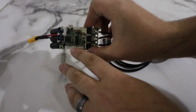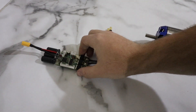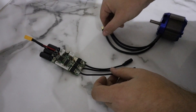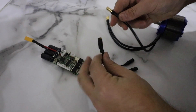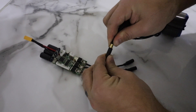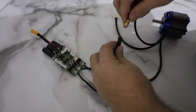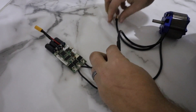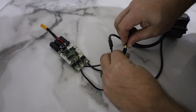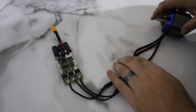Start by checking the version number of your VESC. Next, connect your phase wires to your VESC, starting one at a time. If your motor spins the opposite way, just swap two phase wires.